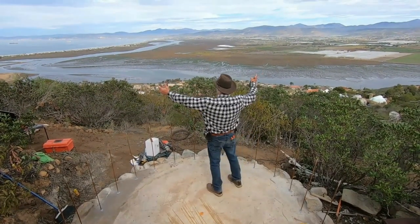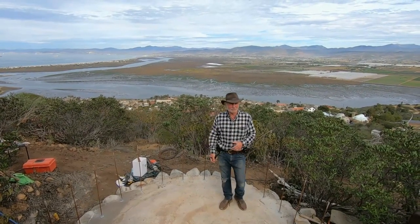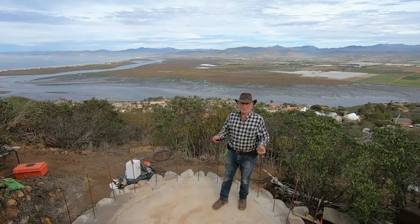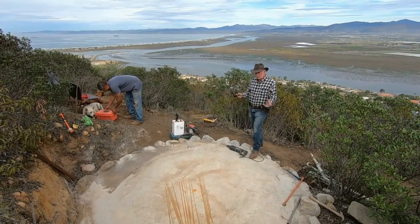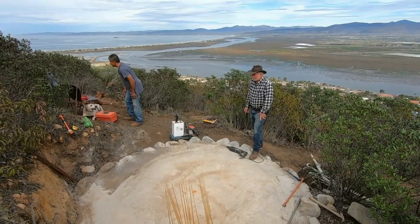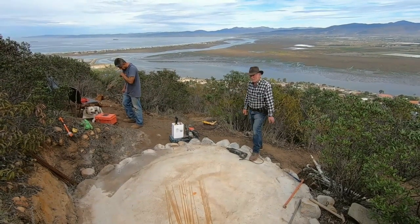So you can come up, sit in this view, and check out the level of the water. Here we are starting a new project using the old slab. This is a slab built with rebar on 24 inches on center, half inch rebar, and it has a ring foundation under it — a shovel footing, maybe a foot by a foot.